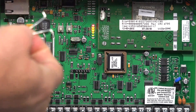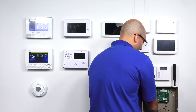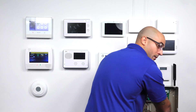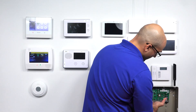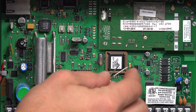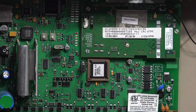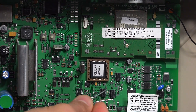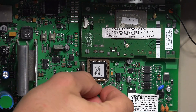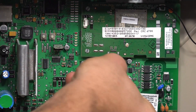On our panel, we're going to have to fully power this panel down. So I'm going to undo the main power plug, and I'm going to undo both the backup battery leads. As you can see, all the lights have turned off and the panel is fully powered down. Now, this little black chip right here is the PROM chip on the system. To remove it, the best way to do this is to shimmy it out using both of these slots right here. I'm going to take one end of my binder clip, I'm going to insert it here, get it under the PROM chip.